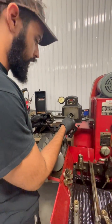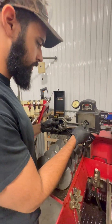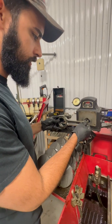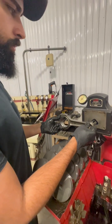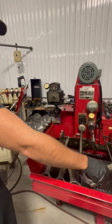Nothing against them — I think they do a really nice product. But I'm at about two tenths clearance, and towards the center there it's down to like seven. It's got a lot of taper through the center of that bushing — like eight to nine tenths near the center. So we just go ahead and try to straighten these things out.